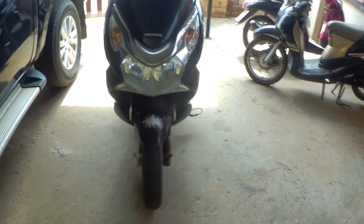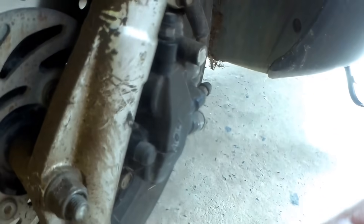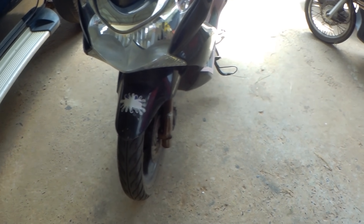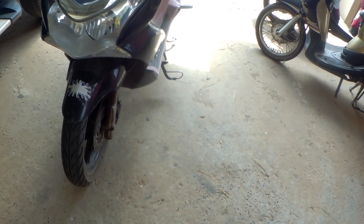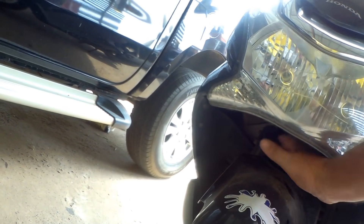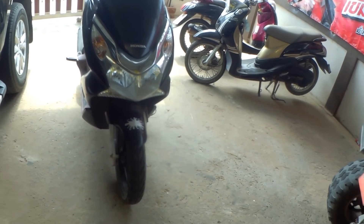While I'm waiting for the glue to cure — look at the PCX. Noticed all this gunk. Looks like the fork seal is leaking. Put my finger behind — it's wet. I'm going to take it into Honda, get them to change the fork seals. It's a job I can do but I can't be bothered making all the proper tools. It's just a case of taking the wheel out, mudguard off, and then you've got a couple of clamping bolts in the yoke either side and the forks will slide out. Getting old now, not much mileage.